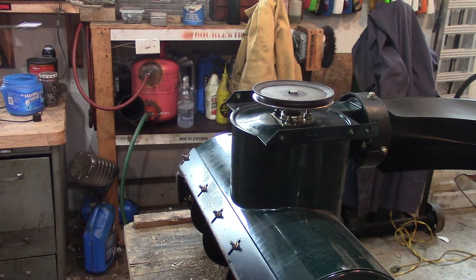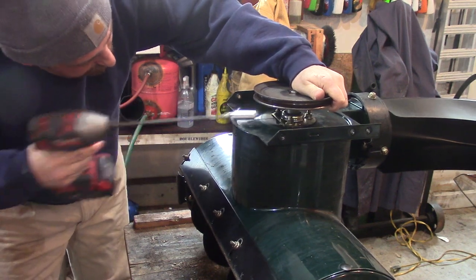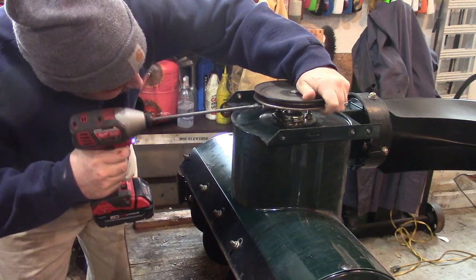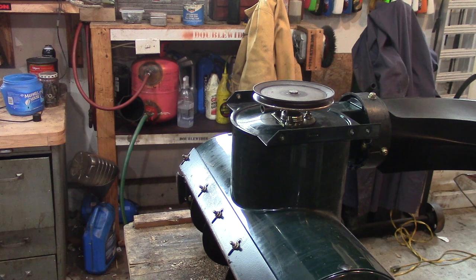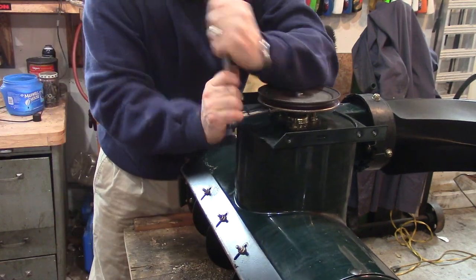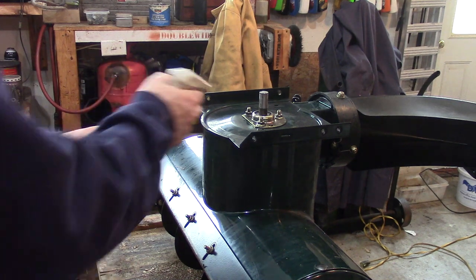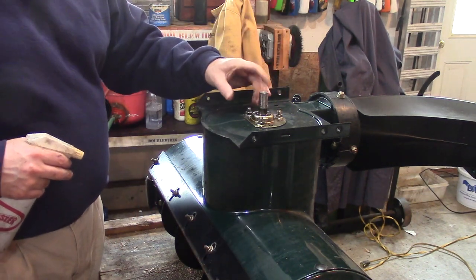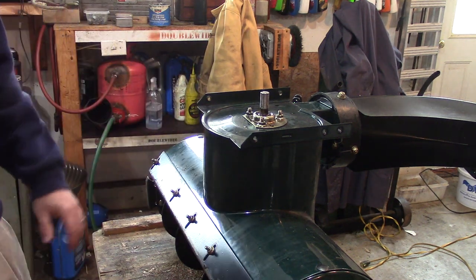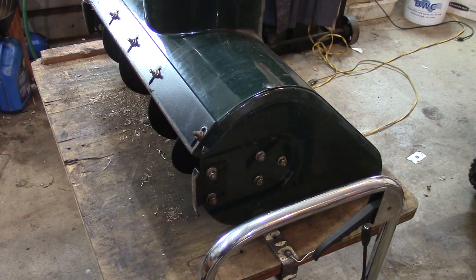I'm trying to pull off this flywheel — there's a half-inch bolt on here, I'm hoping my impact will loosen it up. There are two bolts; I'm going to need a ratchet to get that. Good, at least that's not seized. I'm going to put a little penetrating oil up here. I don't want to pull these bolts out — hopefully the shaft will come out and I won't have to take out the bearing. The bearing looks to be in good shape and wasn't making any noise. Really all I have to do is pull out the bolts down here to release the ends holding in the auger.